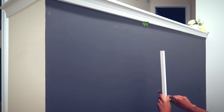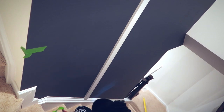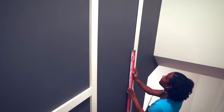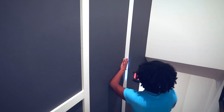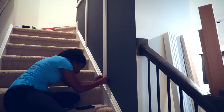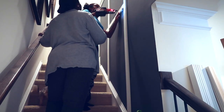I put the board up to the wall — because of the thickness, it protrudes a little off the wall from the top trim, but that's okay. Using my larger level to make sure everything is lined up, I nailed them in with two-inch brad nails. I'm not looking for studs — I nailed them at an angle so they cross within the wall for extra hold. I took the smaller cut piece and lined it up so the vertical boards went all the way to the bottom.